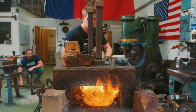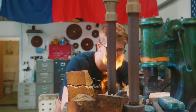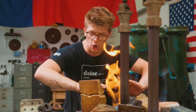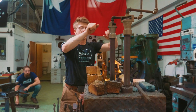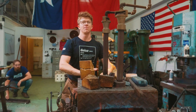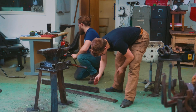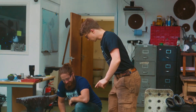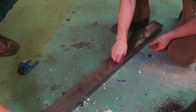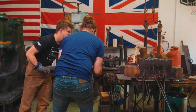It doesn't look like it's cracked, but I want to be really quick right now because the longer we leave it untempered, the more likely it is to crack. While I was grinding it, I opened up the forge doors and turned off the burners — that means we've dropped the temperature. We've got this in there to make it even less aggressive of a heating. Alex has got our heat-evening jig sorted. We're going to take our blade, lay that down on top, put our screws in — how exciting! Into the fire we go.